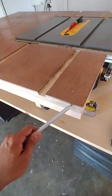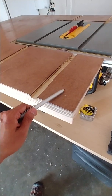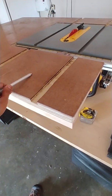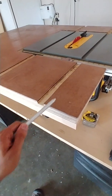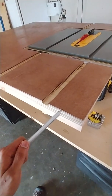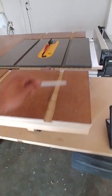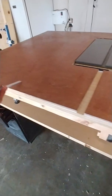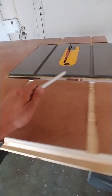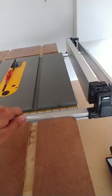What it's made of is basically two layers of half-inch plywood, and on top of that there's a 1/8-inch thickness of tempered hardboard — it has a natural smooth side on top. I got this from Home Depot. The outside rough dimensions are about 42 inches long and about 47 inches wide.